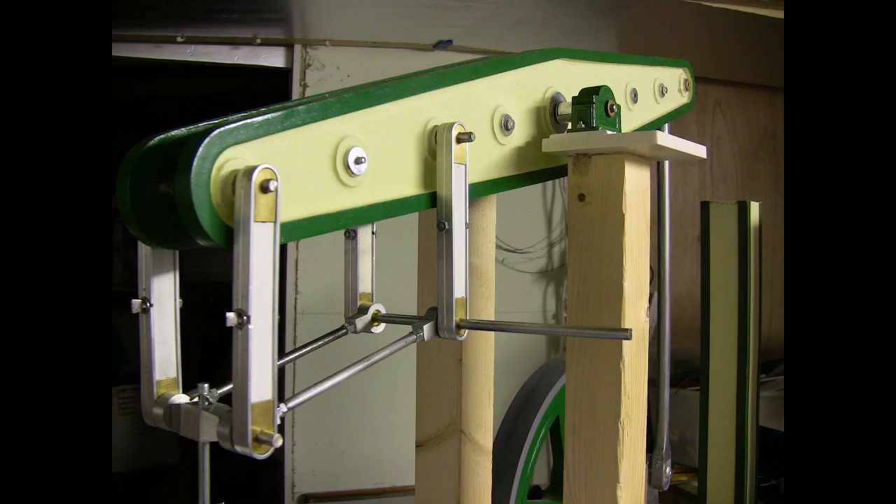So now we have to make a start on James Watt's parallel motion. James Watt invented a system of linkages which you can see hanging from the end of the beam, which actually kept the piston rod travelling vertically up and down by a system of linkages and radius arms. If you note to the bottom left you have the piston rod coming up to the crosshead, which is connected to the two drop links. Where there are bearings halfway up you have the cotter pins, and then the final connection up onto the beam.